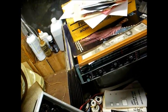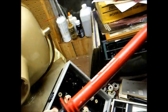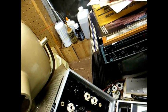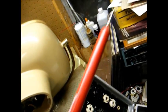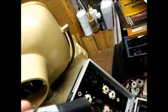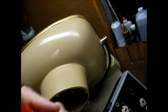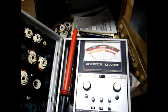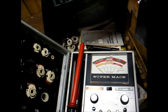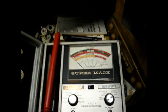I have a high voltage probe somewhere, but I've misplaced it, so we're just using the one that's part of this CRT tester. We have this probe that measures up to 10 kV for checking focus voltage, or you can slide the big long red extension onto the focus probe and go up to 50,000 volts — ample enough for most TV applications. To measure the voltage, just set your selector switch to focus and high voltage and read it on the appropriate scale.